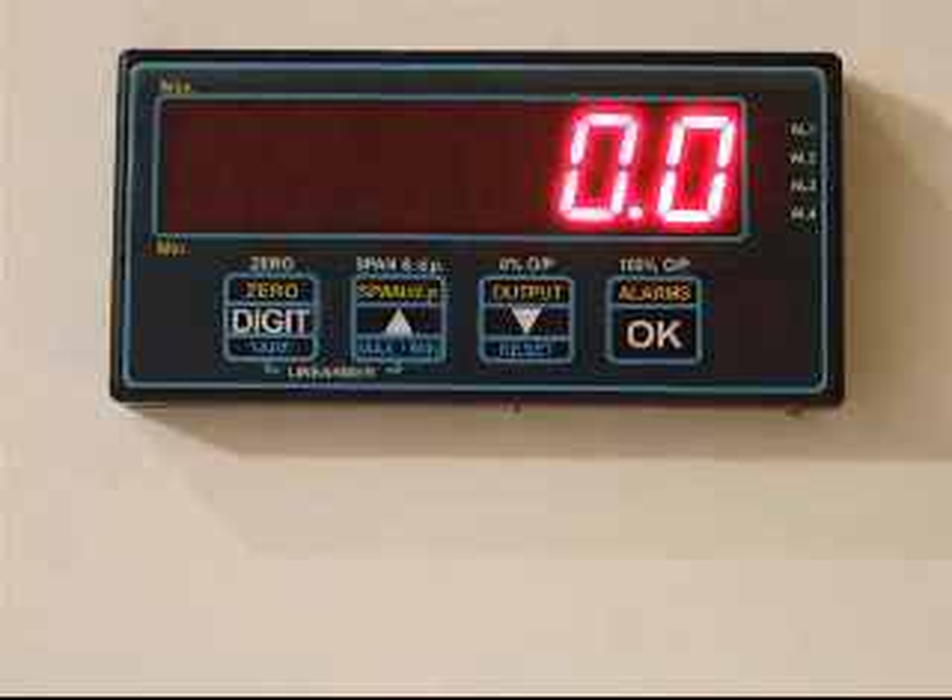The intuitive P and intuitive L have a scale factor variable in them, which allows you to convert an already calibrated meter to read in different units of measure. For example, if you had calibrated the meter in kilograms and you don't want to affect the calibration as such, you can change a scale factor which would allow you to convert from kilograms to newtons, or kilograms to pounds.